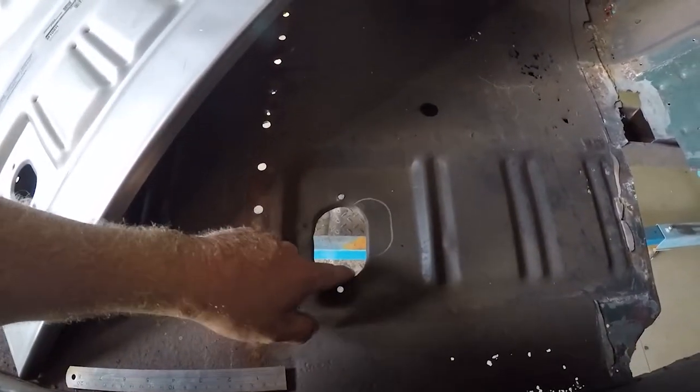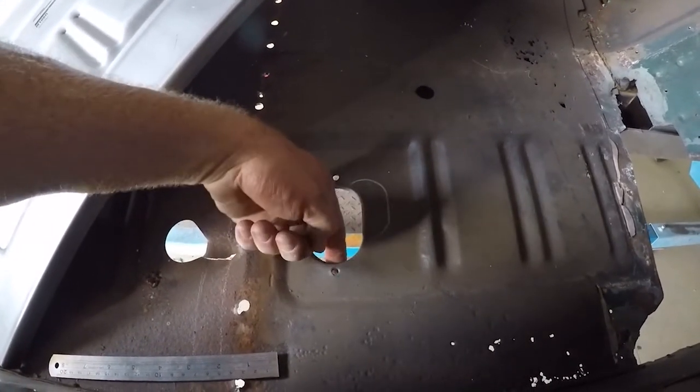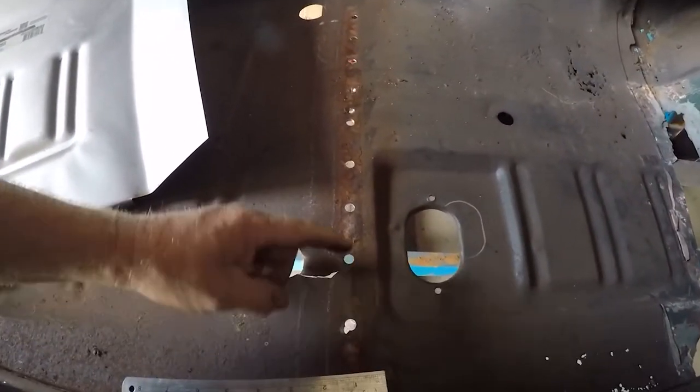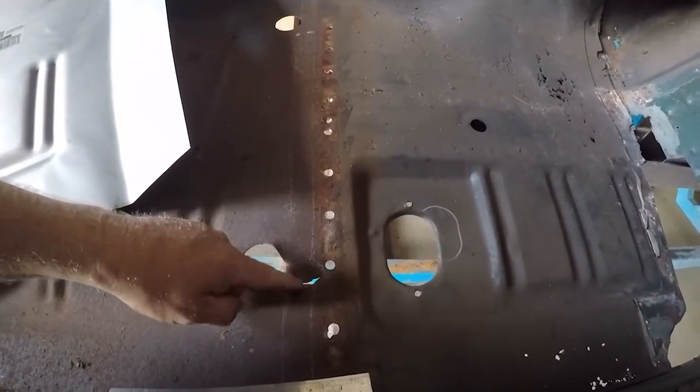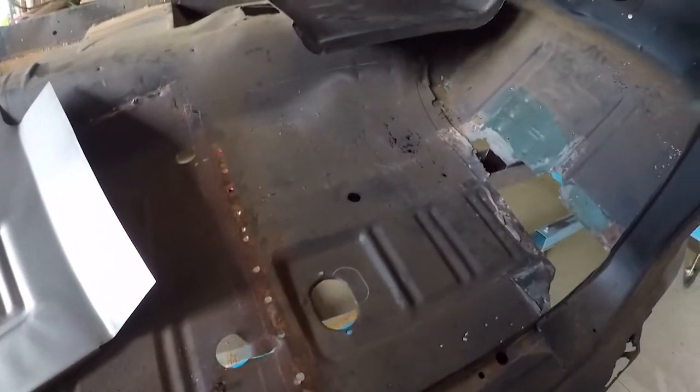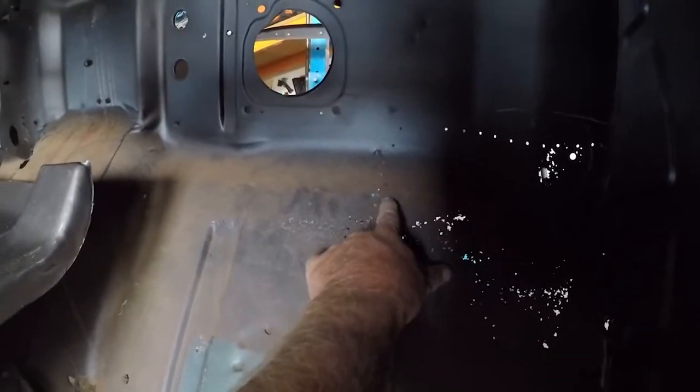When we get it set and fixed in place — the original inspection holes here, the drain hole, where they're called the floor pan recess hole — the other one shows it about here, so there might be a little bit of movement to make that back in the same spot. I'd like to put it back in the same spot. While we've got that seat cap off, I want to fix up this rip that goes through the floor here as well. I've drilled right through these holes for the seat part, but I'll repair all that before we go ahead and put it back in. Just drilling little pilot holes like that through there to know where we're going. I can see where I've got to step around the chassis — there's a tab that comes down and goes across this way, and we know there's a chassis here, with a spot weld just here.